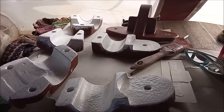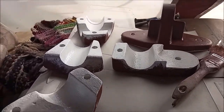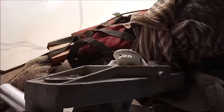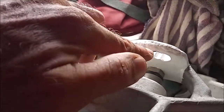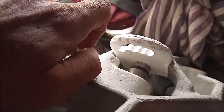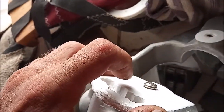Here we have all the pieces for the bracket. There was some quite serious rust on it so I decided to paint them. This is the mechanism - it's aluminium, not brass, unlike the newer models, and I painted it as it was in bad condition. This had a crack going all the way down there so I filled that, but it was already welded on the front with new stainless threaded inserts welded in there.